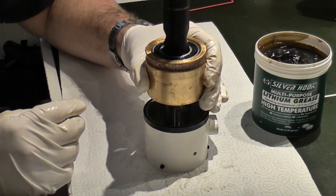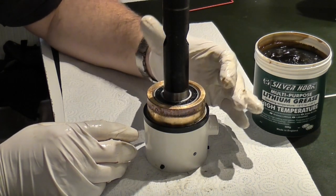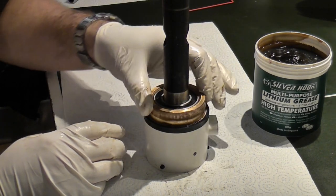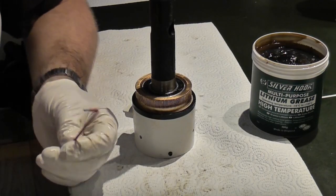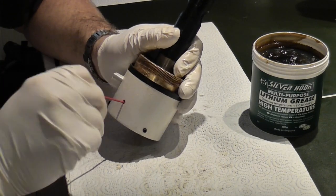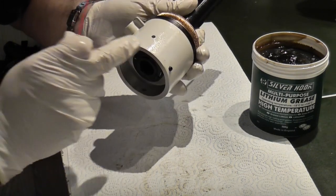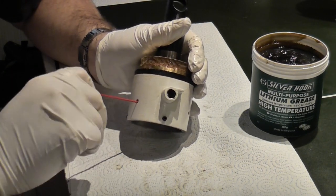And slide it in. You'll feel a bit of resistance as it goes in, as the air tries to escape. There's not much room for the air to get out. Make sure it turns freely. Okay, so with that in, there are three small grub screws in the deck head here. They don't really seem to do very much in this disassembly. I think that's because I didn't take the round nut off. Just make sure at this point that those three are all tight.